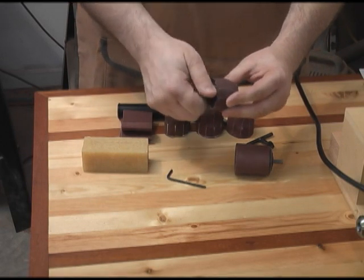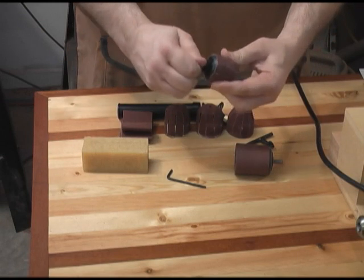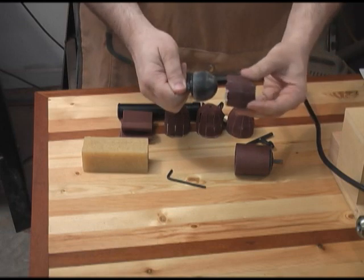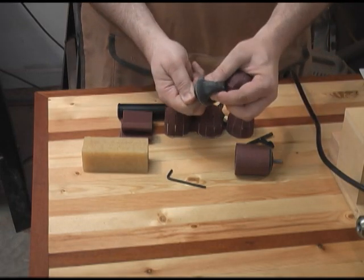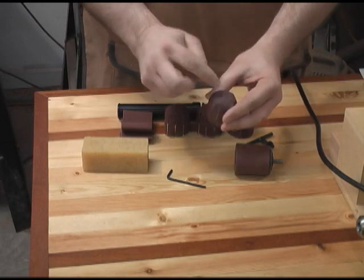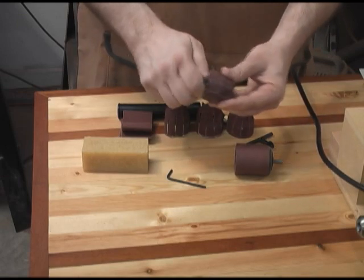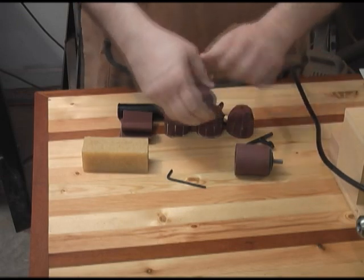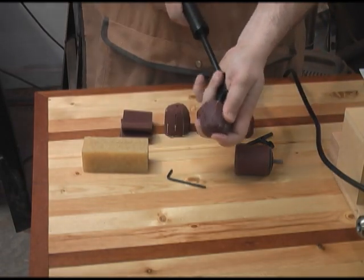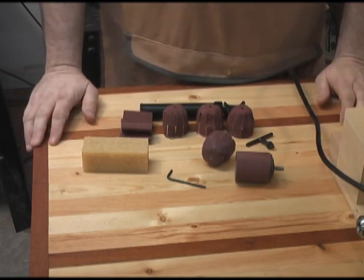The round drum is a little different. It's got a nut here — you just loosen this nut, squeeze on the ball, and wiggle the shaft and you'll hear the air pop out of it. Then you can remove the grit. When you're ready to put the sanding paper back on the ball, slide it on with it deflated. There's a little nipple that sticks through the top — line that up, then tighten the nut down good and tight. Same thing with the pump: pull it out, hold both pieces with one hand, and inflate. That's it for that kit.